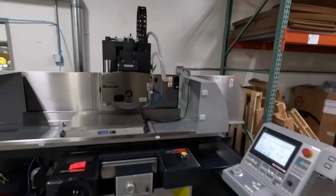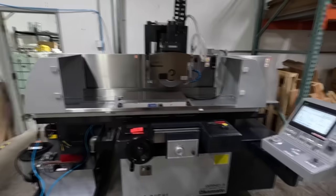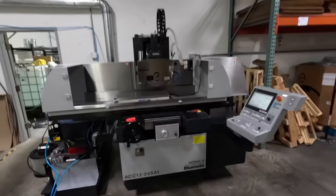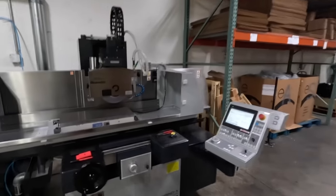The puck chuck is two separate parts — one gets machined, then the second, then they stack together. We need to grind them after assembly, kind of in-situ, to get the accuracy and repeatability we wanted. They make smaller grinders — six by twelve — and bigger ones like 16 by 32. We bought this size because it's the sweet spot. We can fit about eight puck chucks on the chuck at once, and that should be quite enough even if puck chuck really takes off. The larger machines weigh a lot more, so there's more expense on rigging, and from a size standpoint this fit well.